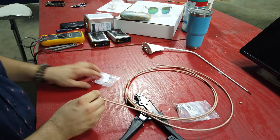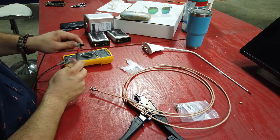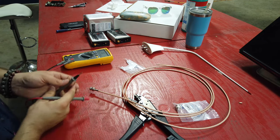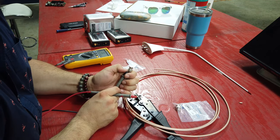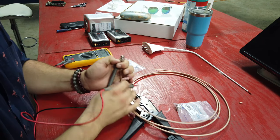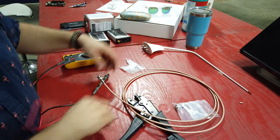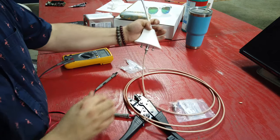The big thing with these connectors is grounding issues, so we're going to grab a multimeter and put it on the audio setting for continuity. We put the ground probe on the outside of our fitting and touch the inside — we don't hear anything, which means this is a good crimped connection with no short. We check the other side too, and as you can see this works out perfectly for my comm antenna.